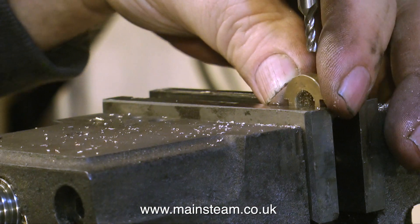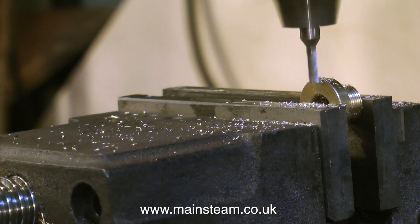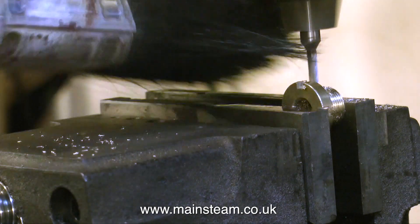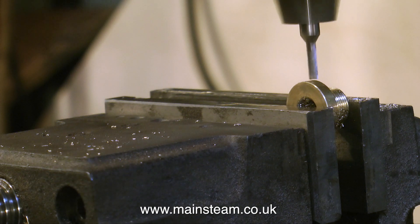This is a very simple job and it's very easy to do. I could use a rotary table — I have one of those — but it will take too long to set up. By scribing the lines accurately and using these lines as a datum against the machine vice jaws, it's really simple. And as you've just seen, once you've machined a couple of the slots, you can use those as the datum.